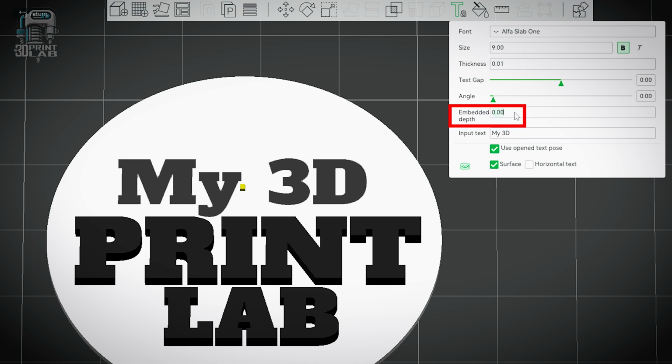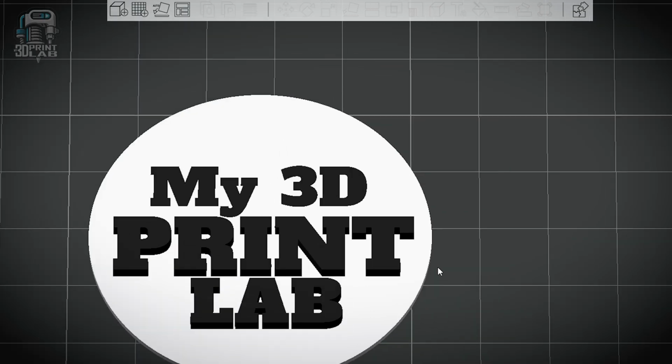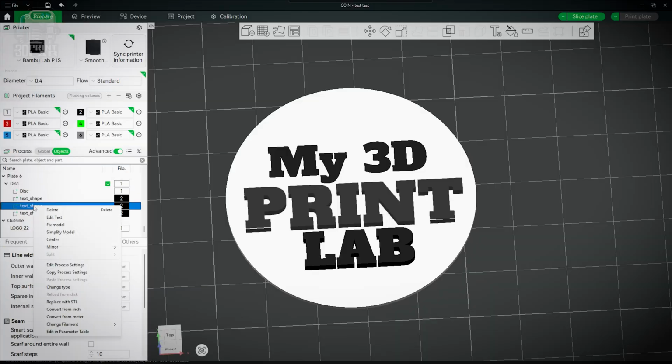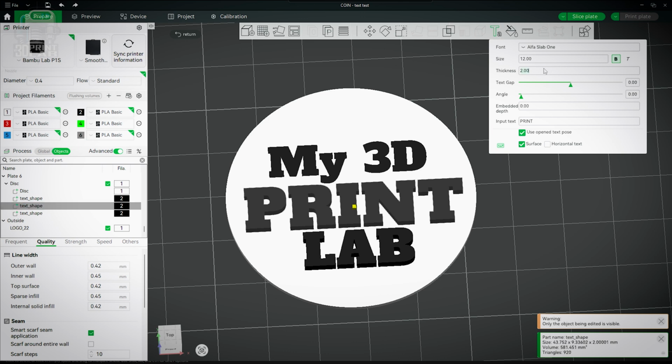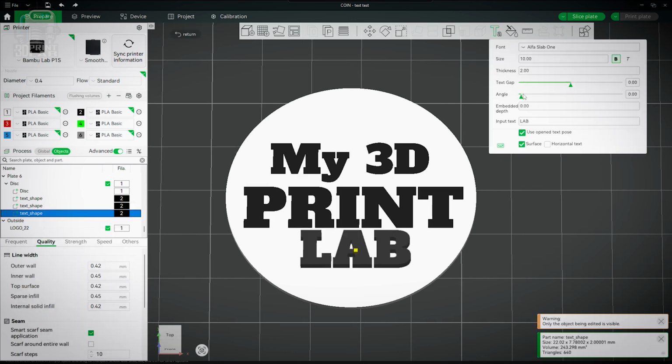Next, we adjust the embedded depth to push that text back into our print. And on my 1mm thick coin with a 0.2 millimeter line height, 0.25 millimeter depth seemed to work well for me. At least enough to show the color, but not so deep it breaks through on the other side. And by the way, you'll see I have 3 lines of text on there, and that means I have 3 text boxes because it only allows you to do 1 line at a time. And it's not the best solution, but it works.